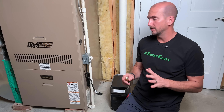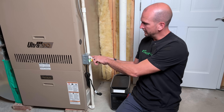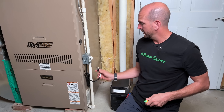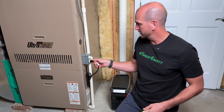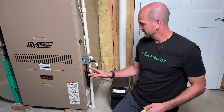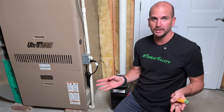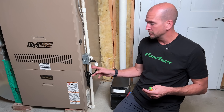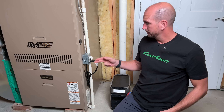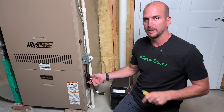The circuit's back on and I want to test things out. I'll get my non-contact voltage tester up, put it into the hot side, flip my switch, and confirm it's hot. We have power and the furnace would work normally under normal operation. I have my wire kind of up out of the way — you don't have to have as long a wire. This is about a five-foot extension; I wanted it long enough to plug right into my portable power station without any additional extension cord. You could have a very short one and then use an extension cord to wherever you need it.